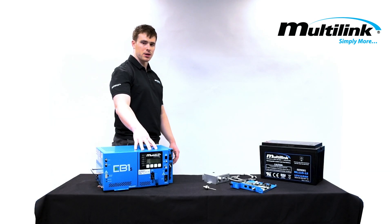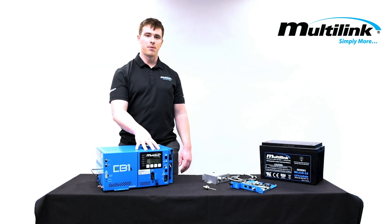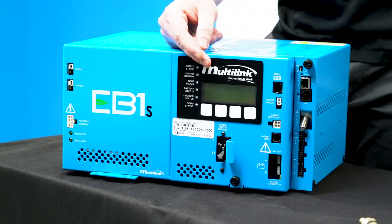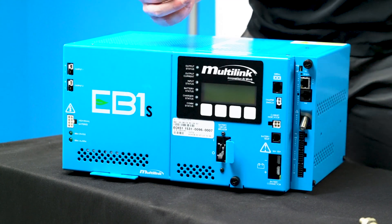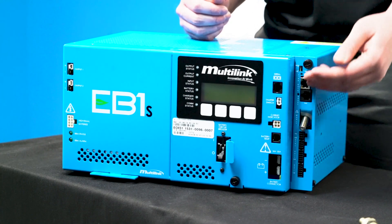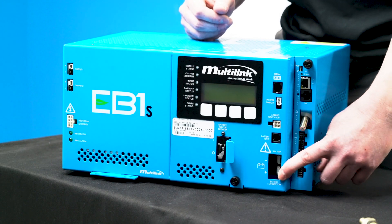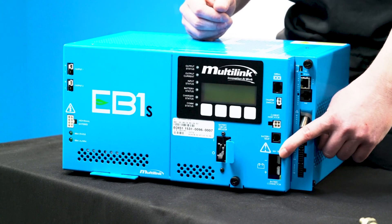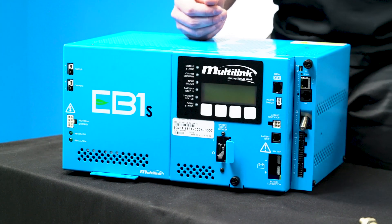On the right-hand side of the power supply is the EB1S inverter module. This is a removable power supply module that has a four-line LCD display and six status LEDs that tell you about the immediate status of the input, the output, and the battery voltage, as well as communication with the transponder. On this inverter module we have a battery connection down here, which connects to a 36 volt or a 48 volt battery string, and it can also connect to lithium batteries.